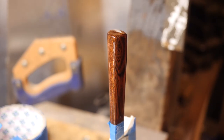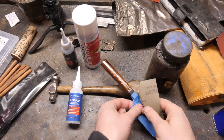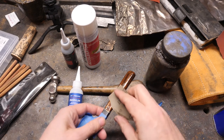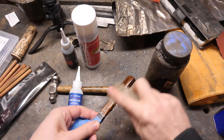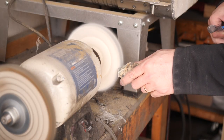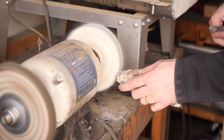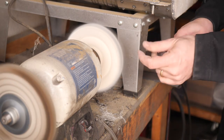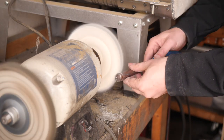Two coats later, I'm going to get after it with some sandpaper — starting at 320, going to 600, then 1000 grit. The 320 should just smooth everything out; there are some lumps and bumps, and the surface will be white and uniform once those are gone, then you go on up. It sands pretty easily and doesn't take long. I put it on a low-speed buffer with white compound on a cotton wheel and it shines right up.